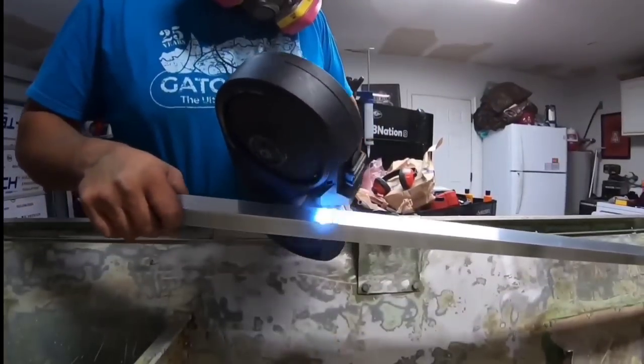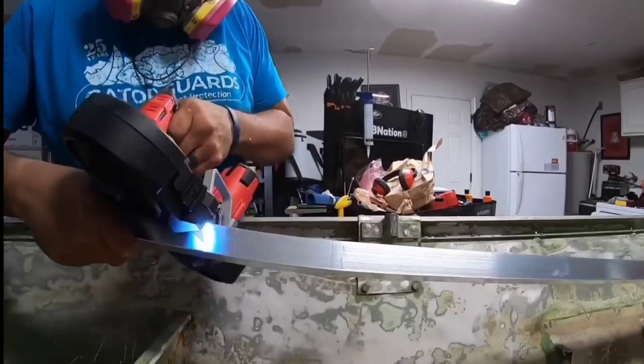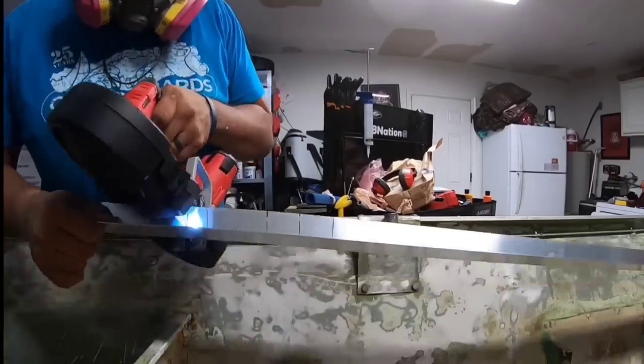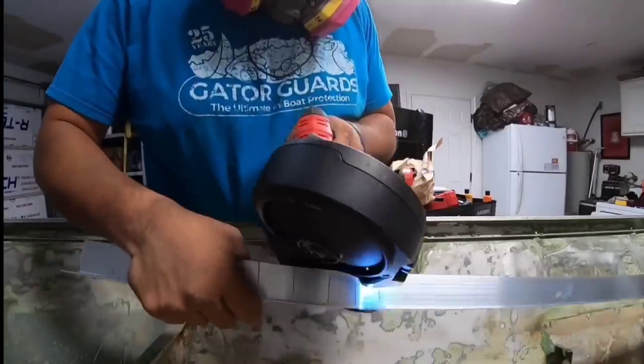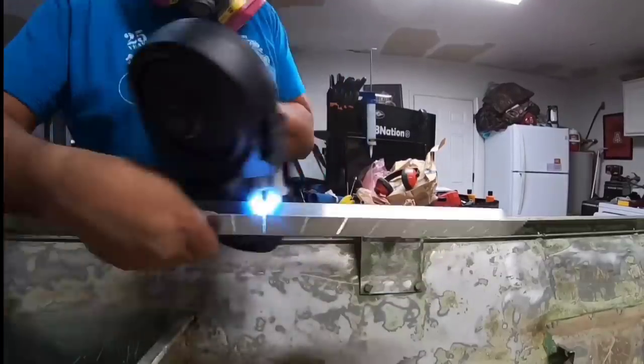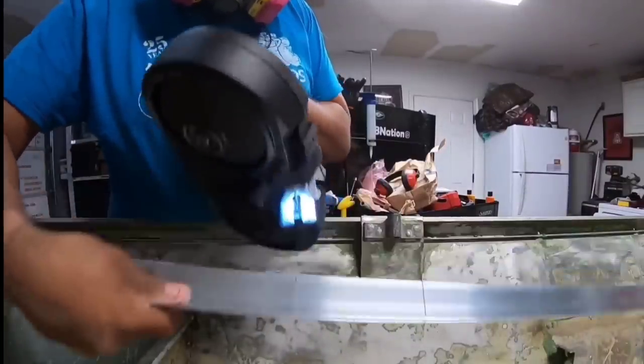People have long asked me how you do the side rails. Well, I'm going to give you a super up close and personal view of exactly how I do them. And if you can't get it after this, then I don't know what to tell you. You also don't need this bandsaw, even though it's super badass. All you need is a pair of serious tin snips, and you can groove it just like this.